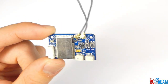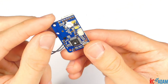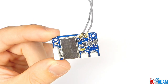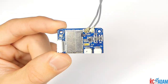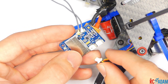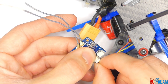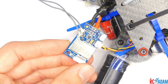Now we're going to look at a receiver commonly used on quadcopters. This style actually has a bind button instead of a servo port, because there are no servo ports — it's intended for use with a flight controller. This one is the FS-X6B, but this will work on a lot of other quadcopter-type receivers including the FLi14 Plus, which is also a fantastic FlySky receiver. We'll connect it to a quadcopter to power it — in this case I'll be connecting it to the iBUS port — but you could also use PPM or sometimes SBUS. That part has to do with the receiver talking to the flight controller, not with the actual binding.